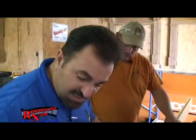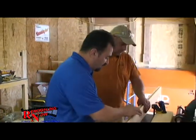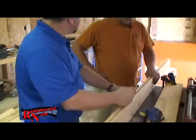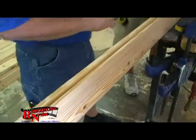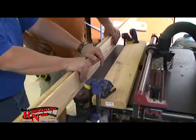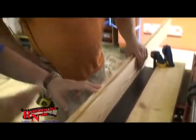As we can see here, we've got a nice trough cut out, which is going to be our groove, and it's right down the center. Now, that takes a little bit of time, but can you imagine having to do this by hand? No, I couldn't. That'd be unbelievable. Thank goodness for modern technology in the form of a router. Now our router is a three-horse router, correct? Yes, it is. And because of what we're doing here, we need to have a little more power. The other DeWalt routers that we have are smaller and would not have enough power to do what we're doing here.